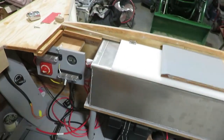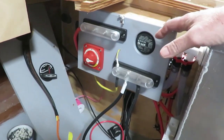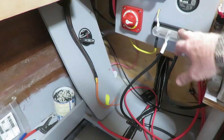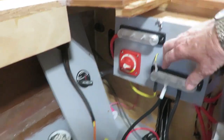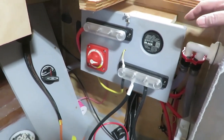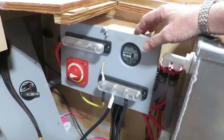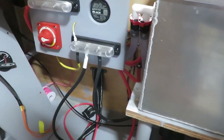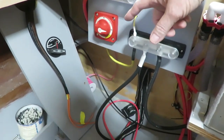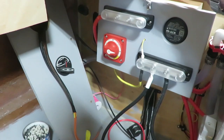Here's a shot of my wiring from inside the stern. I've divided this up into two parts. This first panel is all for the cranking battery, and this is a common ground bus here. I've got a positive bus and a ground bus. This is a battery combiner switch — it's kind of the newer technology from the old battery switch. This switch works in conjunction with this automatic current relay, which controls charging for both the house and the cranking battery. It delivers power where it's needed, when it's needed — same as the old battery switch, except it switches itself automatically, so the operator doesn't have to do anything.